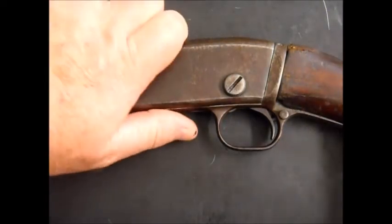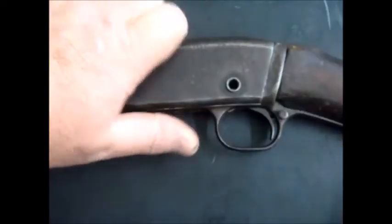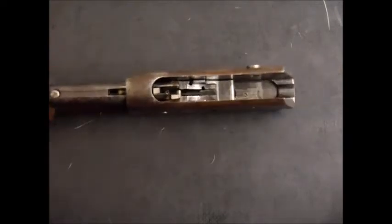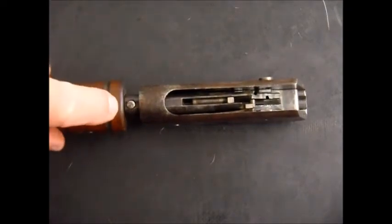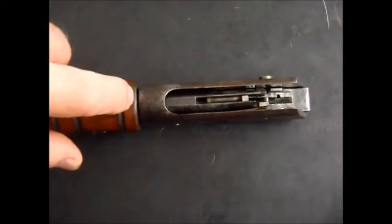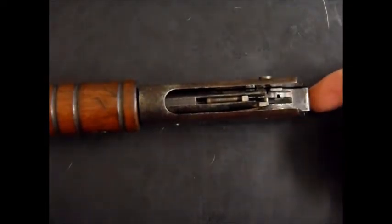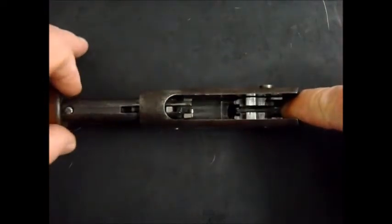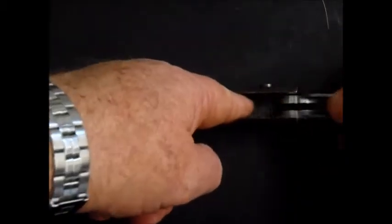The first thing we've got to do is pull the rifle apart — take out the takedown screw and wiggle them apart. So this is the part you're interested in. What you do is put the rifle on its back, find this little button here, push that down so it goes underneath the front of the receiver, and your wood comes hard up against the receiver. Put your finger on the breech block at the back — the silvery bit — then push forward, and that leaves the breech block behind in its little indentation.